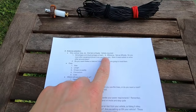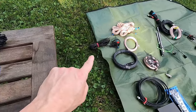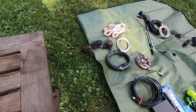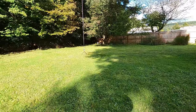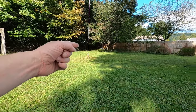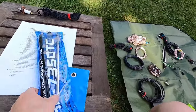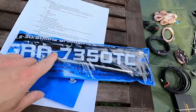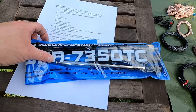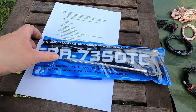When we look at Q, some of these are real low-Q and some are real high-Q. These wire antennas — that 20-meter dipole right there covers the entire 20-meter band. The SWR is good the whole way across. That vertical out there, not so much — you've got to fiddle with it to get it adjusted because it's much higher Q. This Gable, which you've seen in other videos, is even higher Q. With the coils in there it can take some fiddling to get the tune right. I've got it down to a science, but the first time you play with one of these, tiny movements on the coil equate to huge changes in SWR.